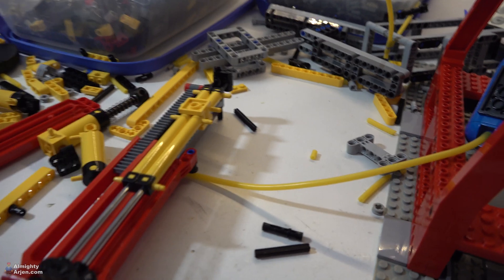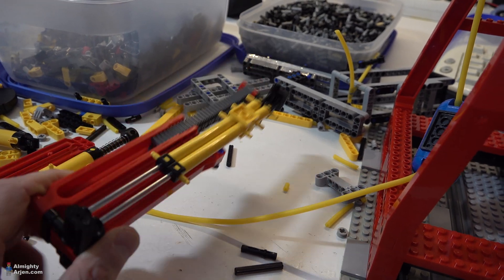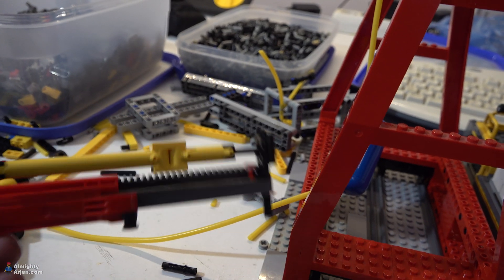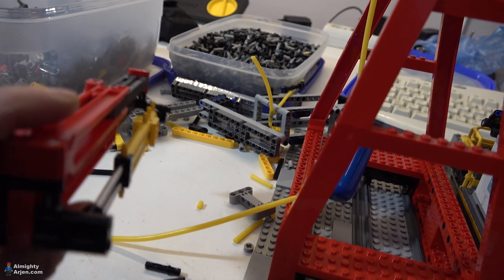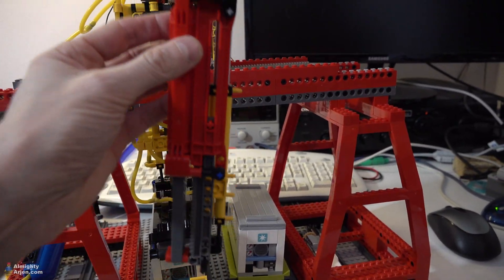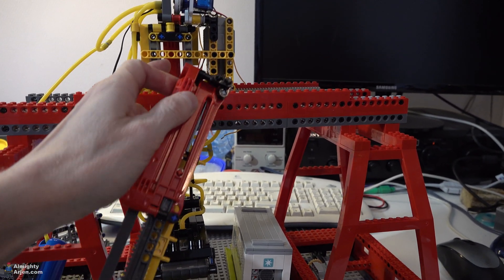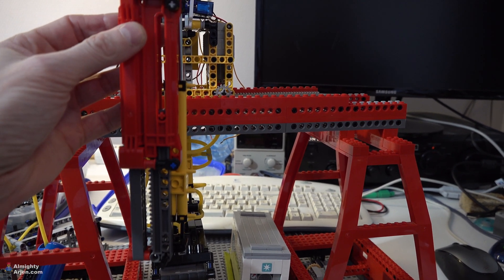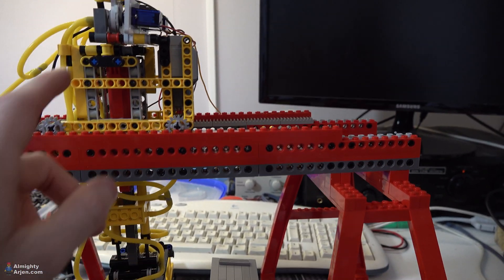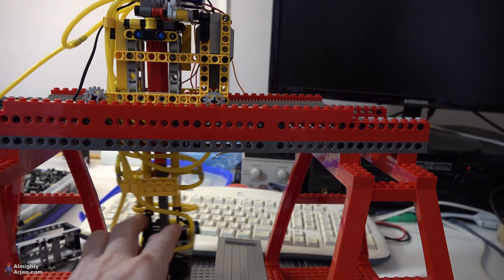What you see laying here is the new version. I'm using two cylinders in parallel because one cylinder doesn't have enough power. I also placed the gear racks perpendicular to each other so they cancel out each other's mechanical play — that works pretty well. This system here has to replace the single one, and we'll see if it's a bit more accurate, because right now it's only fixed up top and you can see it moves quite a lot when extended.